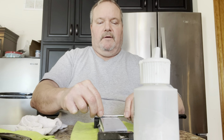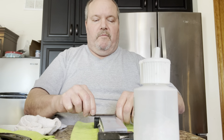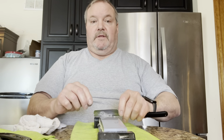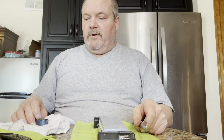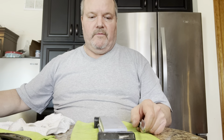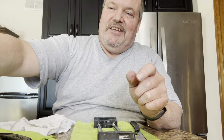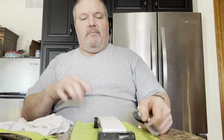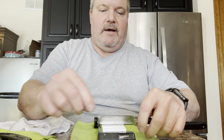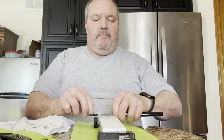You can feel a little bit of a motion across, but not like on the other one. Okay, so I probably almost erased with a 3K. I almost erased the initial bevel set with the long radius stone. So probably now here I am on the 8K stone. Probably this is mostly going to be a polishing effect.